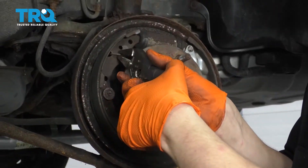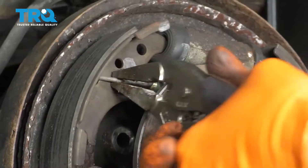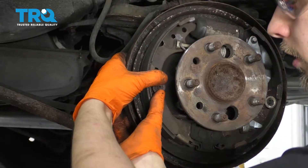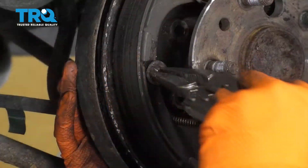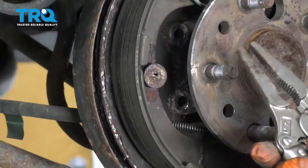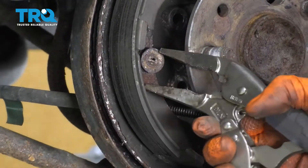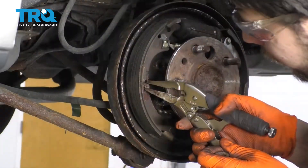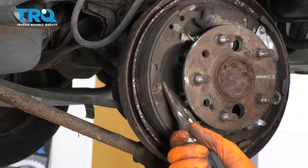I'm going to start by removing this large spring up here. I use locking pliers so I can firmly lock onto the spring, then use the hub to pry it off. Next, you have these little spring retainers. If you hold the pin from the backside, you can push them in and then twist them 90 degrees using needle nose pliers. There's a little slot that has to go through the hole on the cap — you want to match that up and make it fall through. Remove the springs. There's another piece here that's supposed to stay with the spring.